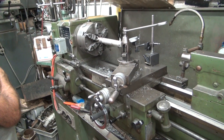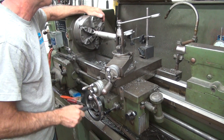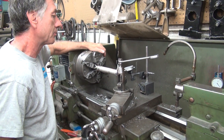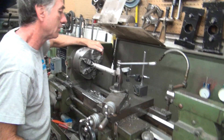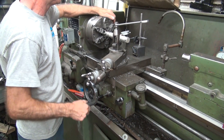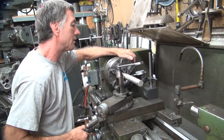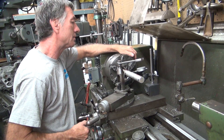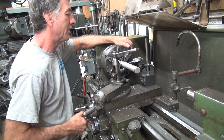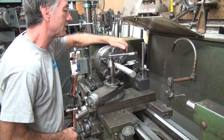That makes sense. Two thou off — you mean you're hitting it the wrong way and it's going opposite? Imagine on the indicator. There's taper from here to here, three-quarters of a thou. In that little bit? Yeah. Depending on what direction you're going, it's three thou there. Difference.